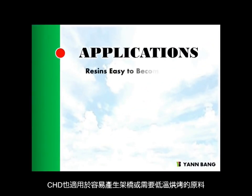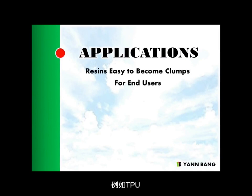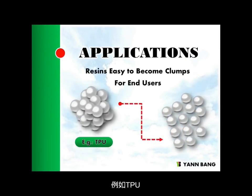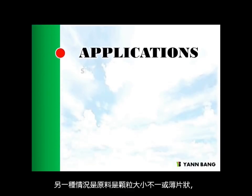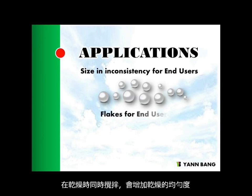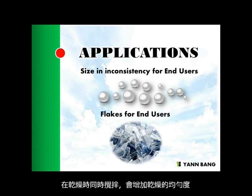CHD series are also for sticky resins, or resins like TPU that need to be dried at a low temperature drying process. If the size of the resin is not even or is a flat shape, resins must be stirred during the drying process to make each piece dry evenly.